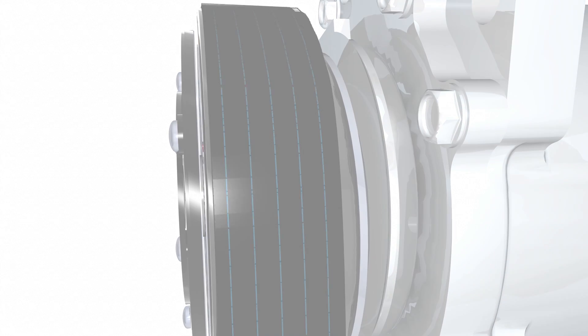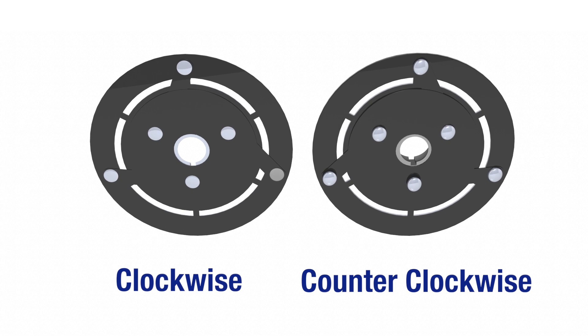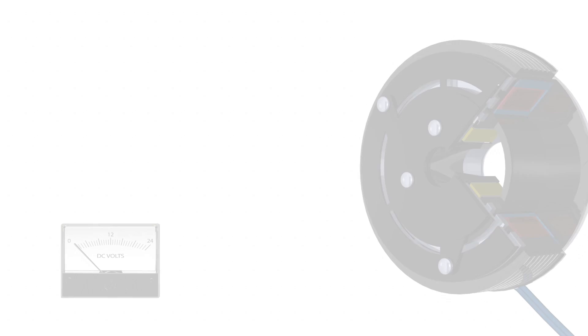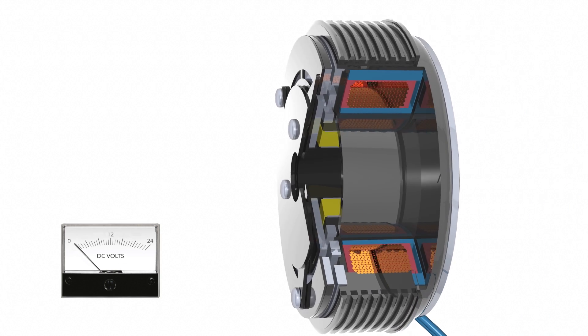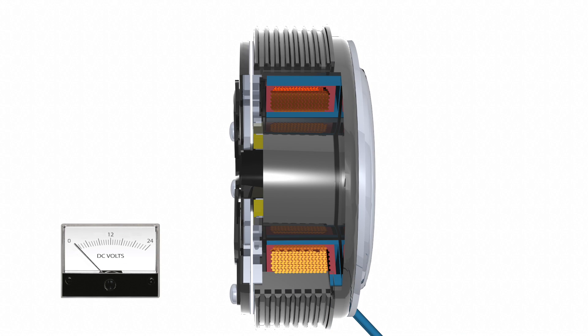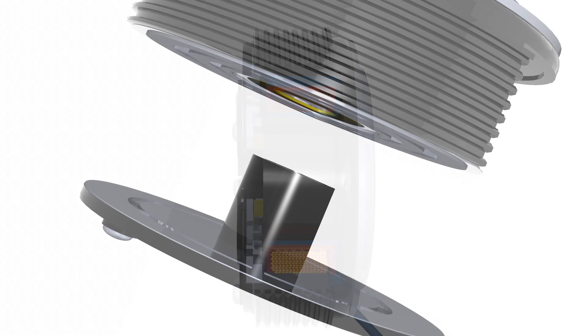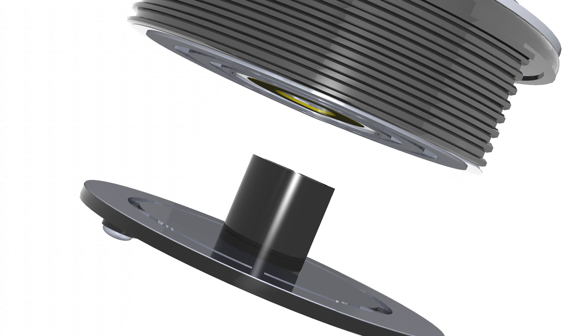The springs need to run in tension, not compression, so clutches are either built to run clockwise or counterclockwise. When the current voltage is removed from the clutch, the armature is pulled away and held in place by the leaf springs, creating a small air gap so there is no contact. In most mobile clutches, friction material is not used and contact between the armature and the rotor is steel-on-steel. But in some special designs, friction material can be added to increase the contact area for high-speed engagements.